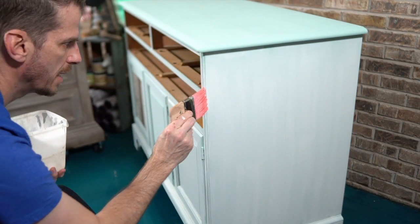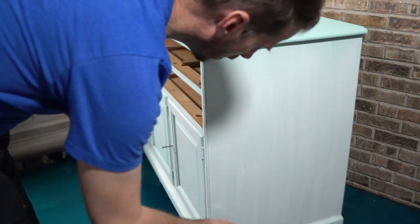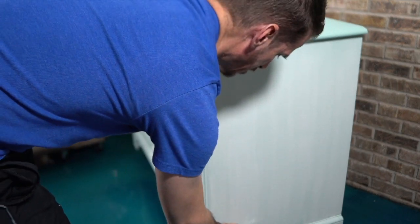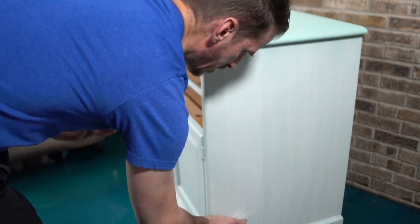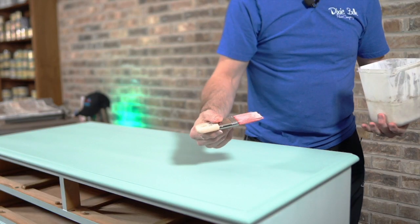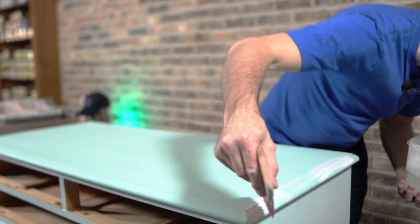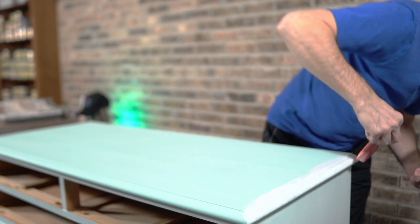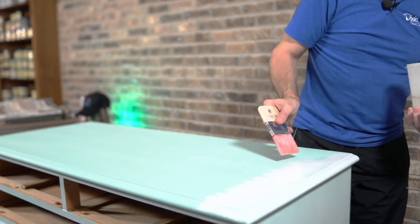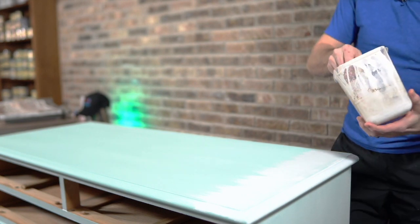Look how nice it is to just run that down the corner - the brush is so narrow it comes in handy. I might just keep an eye on things - looks like I've got a little bristle right there but it's still wet, I could still go back and touch it up. Try not to do too much after a couple minutes because you might be adding more whitewash to it. Okay, so I'm going to go against the grain on the top and do the edge - just like that - then quickly correct that. If not you'll have a dry line there and you don't want that.